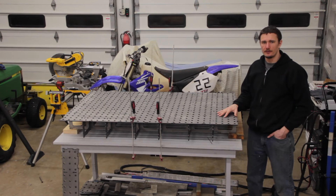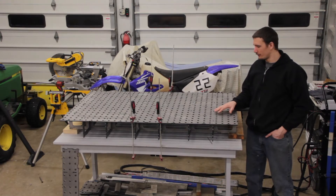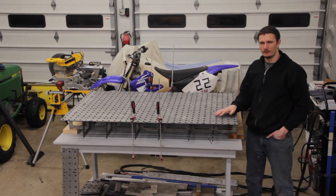I checked flatness and found that I have a little bit of a bow in the center of the tabletop. So before I tack all the tabs and slots in the top, I've used bar clamps to try and bring the bow down and correct it. I actually think that when I install the sides the bow is probably going to go away, but we'll wait and find out.